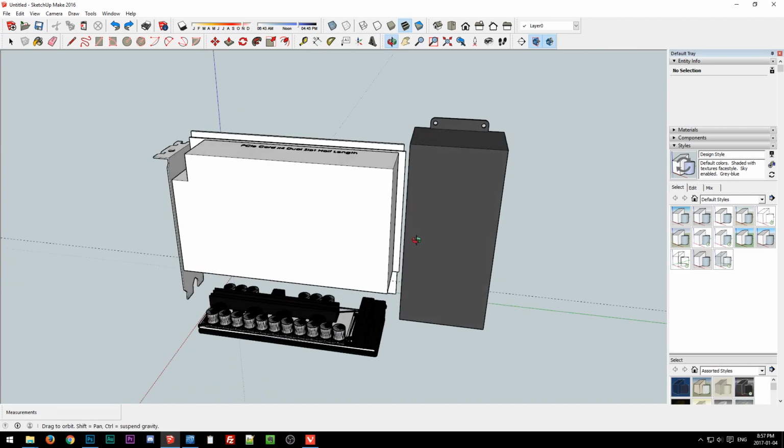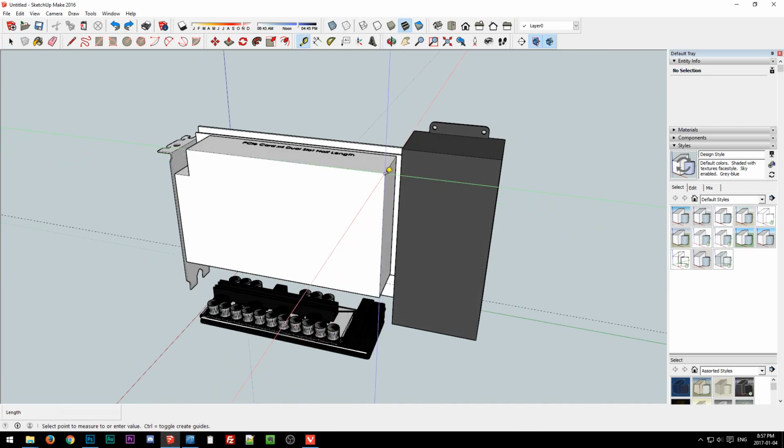Not very much, so that's pretty short. But like I was saying, if we do go with this type of design, kind of a multi-purpose AC/DC unit where you can have it internal, or you can not have it and have a longer video card, then that would give us, for instance, about 240 millimeters. So that's pretty good, actually. That would cover a lot, like 160, 170. That's going to really limit your choice of video cards, whereas 240, 250-ish, you'll have quite a few options once you get into that range.